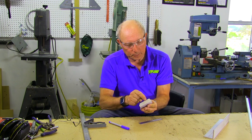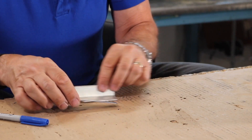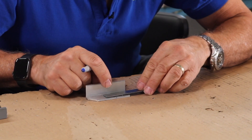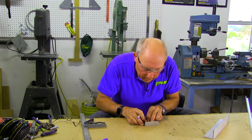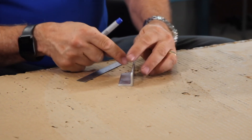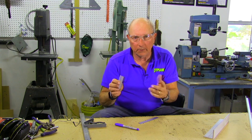Let's go back to the other end — the complicated cut. On one side it looks very simple and we could put it on a block of wood and run it through the bandsaw that way. But a more accurate way is to run it the other way. The problem is this thickness gets in the way of drawing the line. We know we want to come out one inch here to get our 45. We mark that, and then knowing that this is an eighth of an inch thick, if you do the geometry and come back this way and measure an eighth of an inch, you can then draw a line which projected will take us all the way out to that vertex. If you're going to do something like this, I'd recommend cutting this complicated end first, leaving the piece a little bit long, and then cutting the other simpler end to the proper length. That's the best way to get a precisely made part. Now we have something we can cut on the bandsaw and finish on the sanding disc.